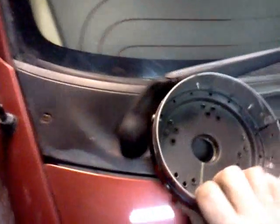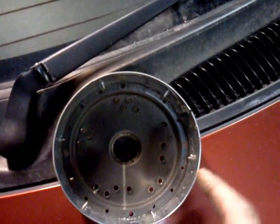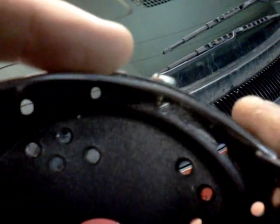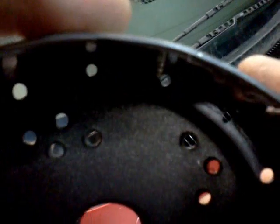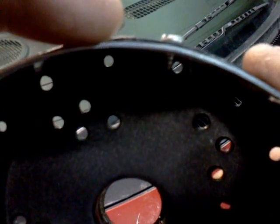As an extra measure, I drilled and put some sheet metal screws — the profile's low — all the way around, evenly spaced, six of them. It took a little bit to get the measurement right, but I used a pair of dial calipers and gapped them all perfectly, then drilled the holes. So now I don't have to worry about the banding coming loose, because super glue on metal will hold temporarily, but hot and cold temperatures change the consistency of the super glue and it will pop off.